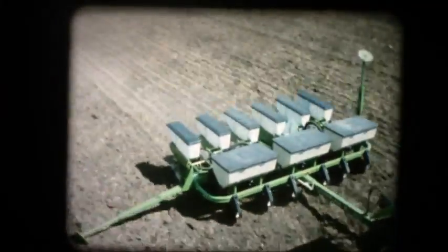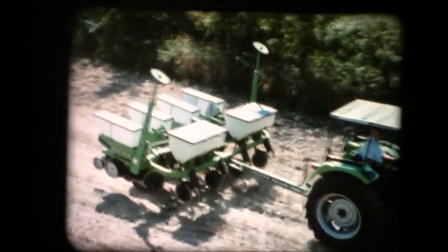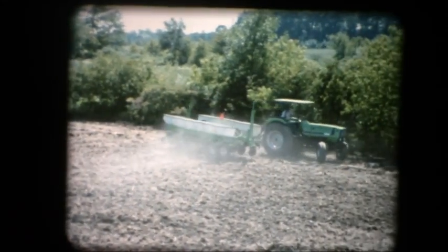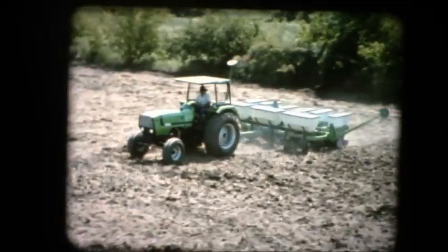The front 3-inch by 4-inch member wraps around the main frame to provide a rugged mounting for attachments. The transport lift system features big 9.5L tires for plenty of field flotation. The patented hydraulic cylinder lift system automatically re-levels the frame, and on larger frames, the transport wheels have a walking beam type of re-leveling system — a big help on uneven ground. Two transport wheels also power the common drive system; this dual drive increases reliability and transmits power to the planting units and to the fertilizer and chemical applicators.